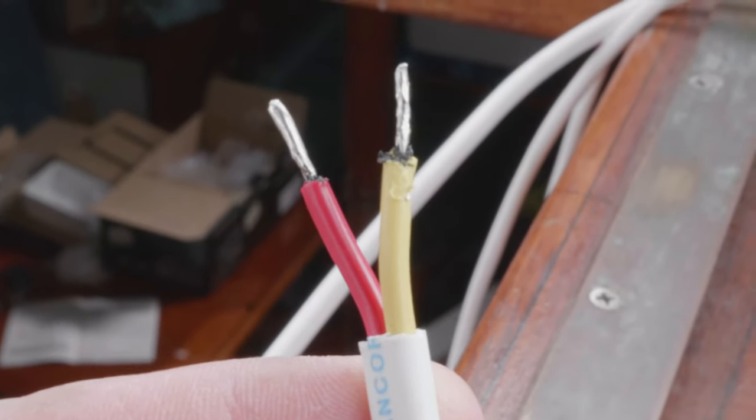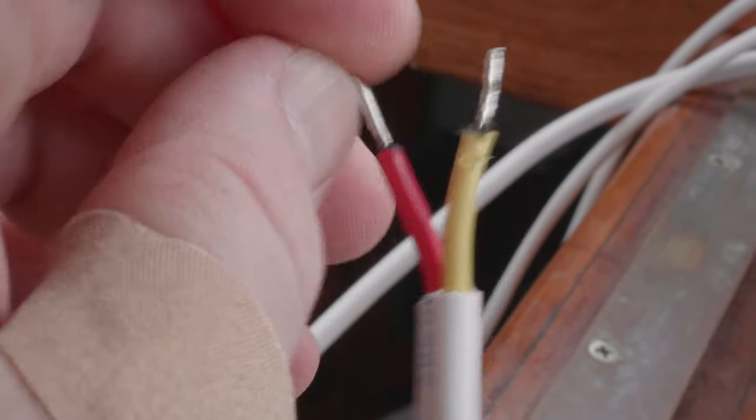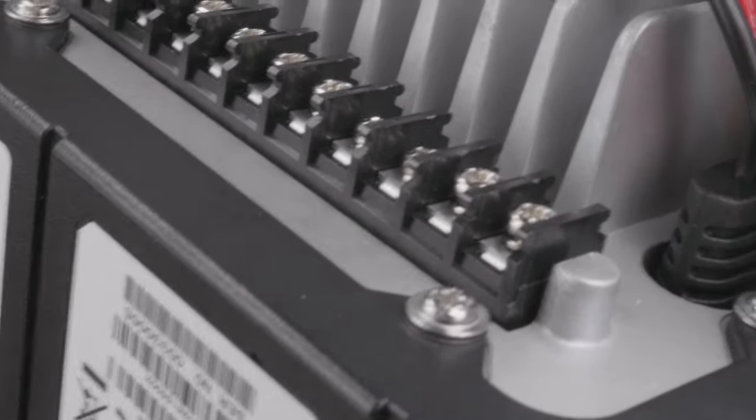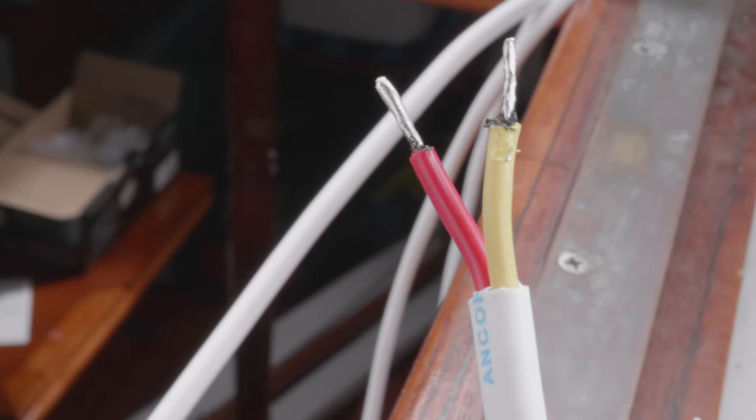Today I am going to install the loud hailer — finally! We spent the last couple of days installing and running wire; I didn't really show you any of that because it's really boring and you've seen it a million times. What I'm doing right now is soldering the ends of the wires, because I won't be able to put crimp connections on them and you don't want the wires to splay out when you wrap them around the terminals. You can see I've soldered the ends of these — now they won't splay out when I wrap them around the terminals, which are these teeny tiny screws. It's too small to fit any of the crimp connections I have, so this is how I'm doing it.